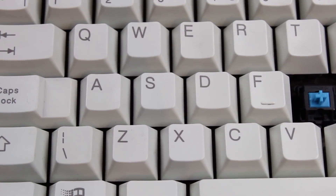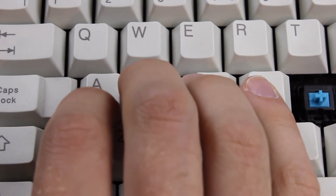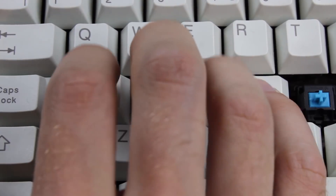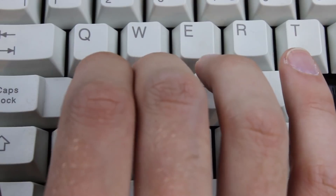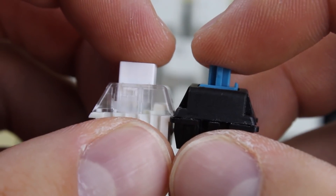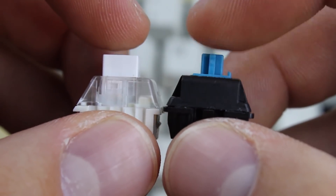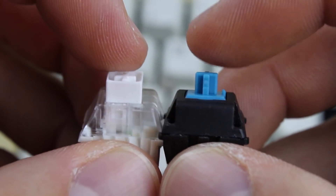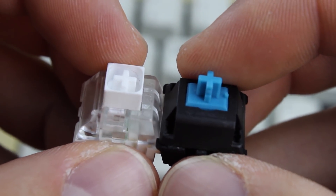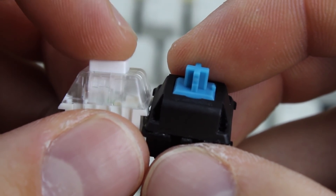Finally, there's the noise, and this is where it really diverges. MX Blue is known for the nasty, plasticky, high-pitched rattle it produces, which is arguably the worst clicky sound of any switch out there. These have an even higher pitch on the clicker, but being made out of metal, the bar clicker doesn't rattle — it's a crisp metal tick instead. Moreover, although the clicker is more high-pitched, the switch action itself is actually deeper sounding.